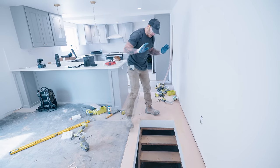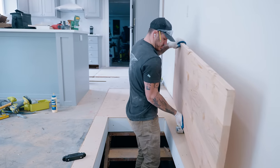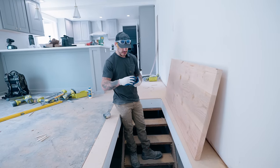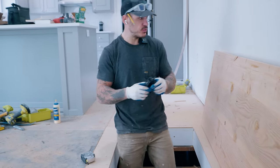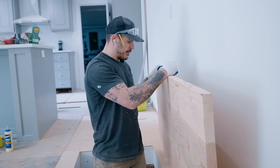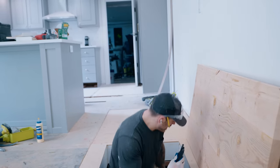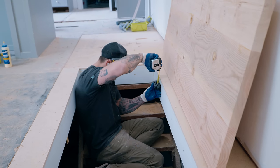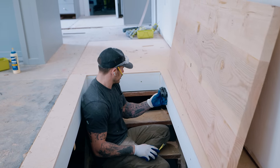One perfect cut. I took the liberty and cleaned up my door and it's ready. Now here's the hard part — I got these concealed hinges, I'll link them. They're heavy duty, two of them, and they advertise that they can be adjusted in three different directions. They mount on the edge here, so I'll have to figure out how to route that through because there are three different tiers. No template and the instructions are in Chinese — literally in Chinese. Then once I get it mounted there, the second problem is getting it mounted here, lined up perfectly, and having it drop down to the direction I need. A lot of moving parts here — I'm going to need to put on my thinking cap and focus.